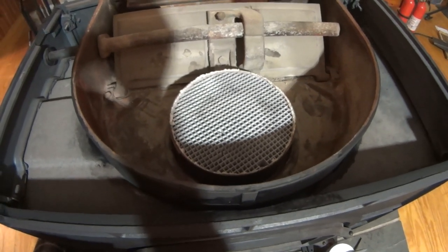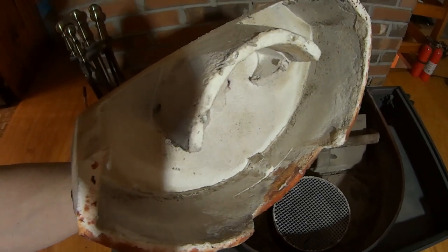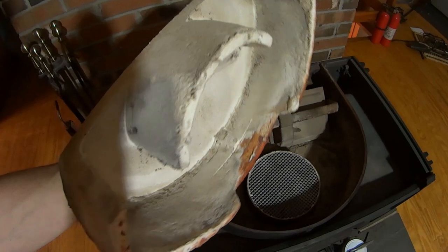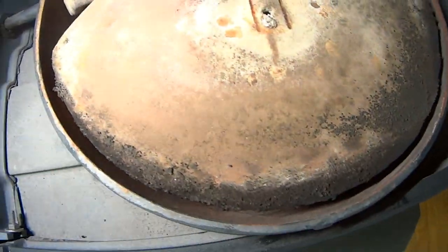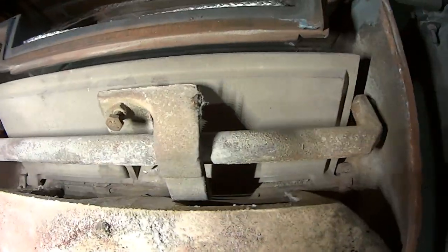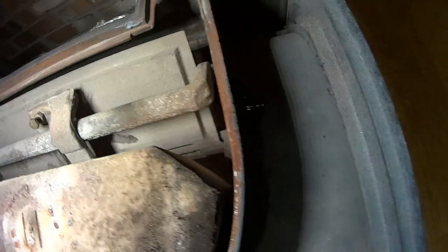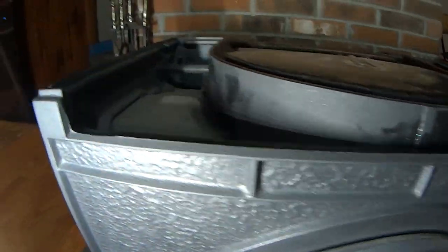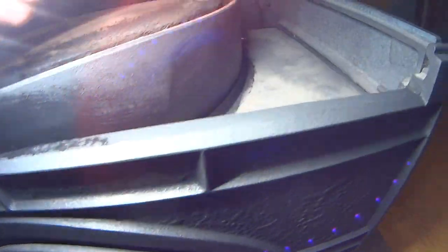We haven't determined if this is good or not, but we're going to run it and see. The other thing in this stove is this hat-type thing — it looks very delicate. I'm going to just put it back in its place. You have to be careful when you're removing the top — make sure you take the thermometer out or else it damages it. It comes through this little hole. I'm going to put this back in and then put the top on. Hat's in place. You can see there's just a little bit of space all the way around it. The door opens and shuts without interfering with it. You can see the catalyzation paths. I did stove black just the face of this — I'm not going to do down in here on this flat, because the lid actually overhangs it and you shouldn't really see it, and it's always probably going to be dusty in there anyway.